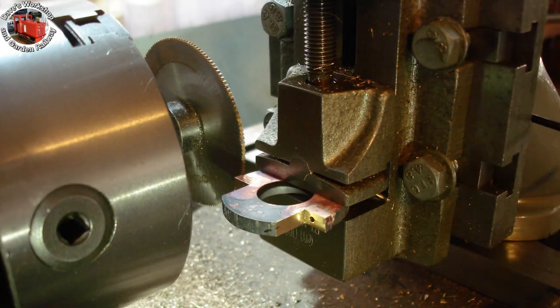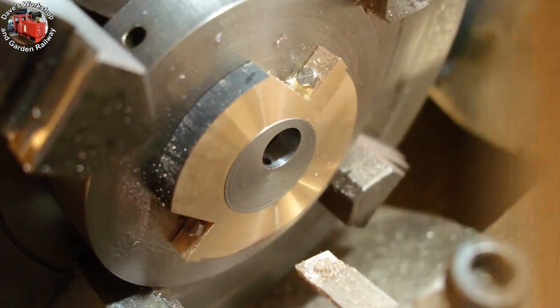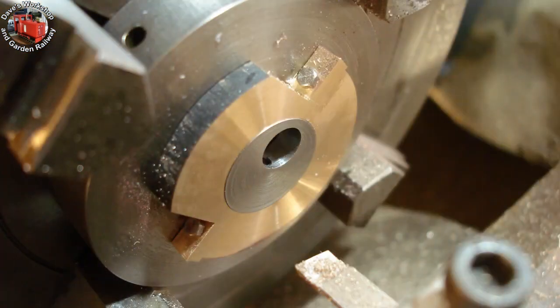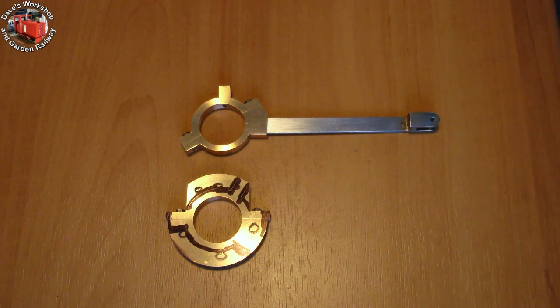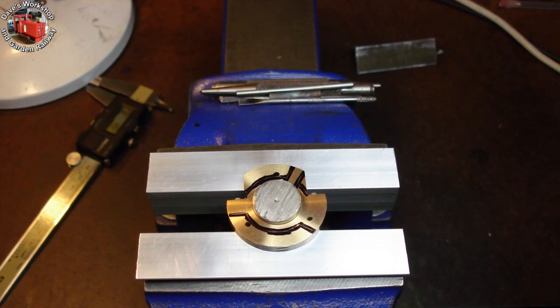Slitting the repaired strap after drilling the screw holes. All three remaining straps are ready for boring and skimming to width in the lathe. The repaired eccentric strap after facing and boring — testing it with the eccentric. I scribed around the profile of the first shaped strap with both pieces mounted on a piece of three quarter inch bar, marking the circular sections with calipers from the bore to maintain a one eighth section. The first piece went a bit undersized in places as I bored it last.